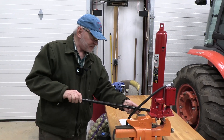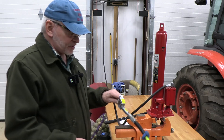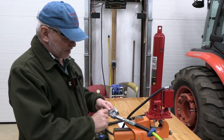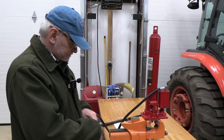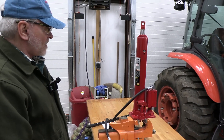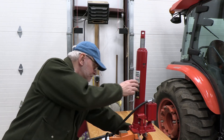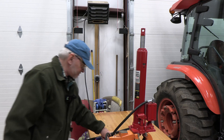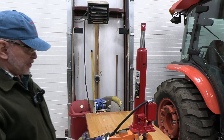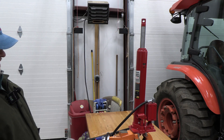Let's run it with some air now. I'll close the return valve — this will accept air pressure at 100 to 120 PSI. I have it at 120, so let's run it through its loops and see how it does. I'm going to turn it on, clamp it, and watch it go up. It's working well — rising very nicely and smoothly. We'll do this again when we have it installed on the crane.